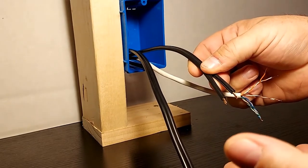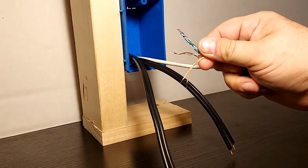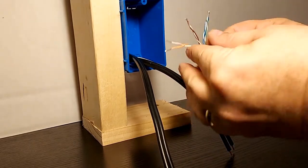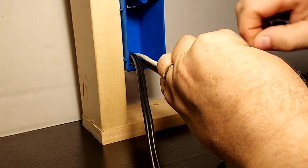We're going to want to strip the speaker wires around 3/16ths of an inch. Make sure you twist them tight so there's no stray conductors, and we're going to do the same thing with our Category 5 cable. Here I took four of the conductors — in this case the blue and green pairs — tied them all together, and the brown and orange pairs are going to be my positive. So I'm going to twist them together and trim them to fit.